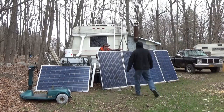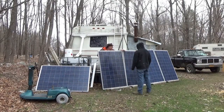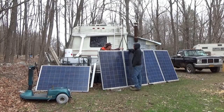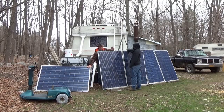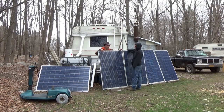What we're doing today is we're going to take off the 200 watt solar panels from the main array — it's snowing, not really a blizzard. I'm yelling because I don't know if the wind is blowing on the camera. We've got two 235 watt panels over here and two 200s, which was improvised. I've got another 235 that I'm going to be putting on here. Occasionally I get an over-voltage indicator on the charge controller, so we're going to take off these two and only have three. That'll solve that problem. Then these two are going to go with a third over up against the tiny house, and then I'm going to have another pair out further in the woods so we'll get full daytime sunlight from all three different positions and hopefully increase the total amount of solar power brought in to the tiny house on an average day.